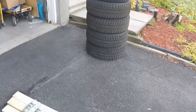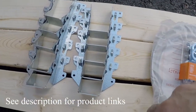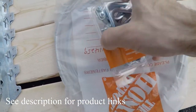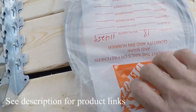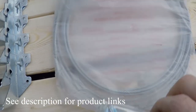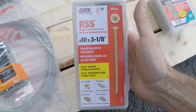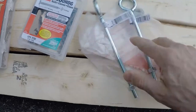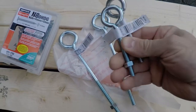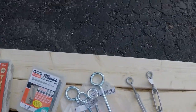In this video I'll be building some tire racks for overhead garage door storage in my garage because I'm running out of space. To do this I got some 2x4s, some 2x4 hangers. I have these Ever Built wire rope clamps — they are terrible, I would not buy Ever Built again. I got 1/8 inch steel wire rope, GRK structural screws rated to 840 pounds, these number eight nails, a couple long eyelets, a couple short eyelets, and then these adjustable clamps. Obviously you're going to want a tape measure and some stuff to cut wood — maybe have a coffee as well.